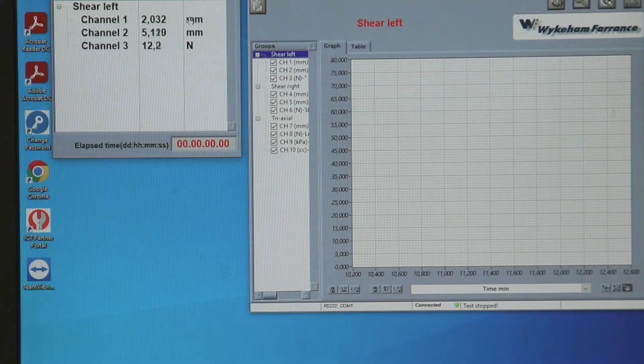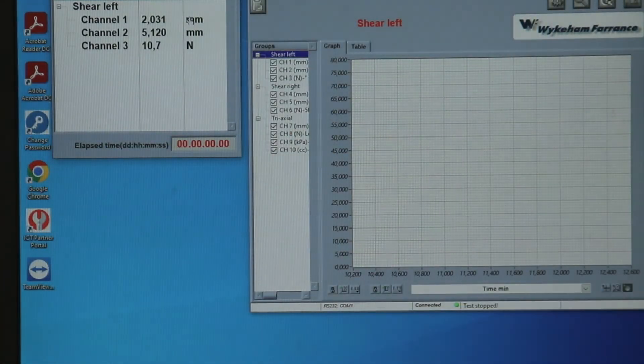Wait 15 to 30 minutes for soft clay soils and 10 to 20 minutes for more granular soils. Stage 4: starting a test. Familiarize yourself with paragraph 7 of ASTM D2850-15, paying extra attention to procedures, strain rates, and stroke limits.